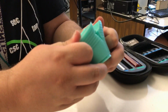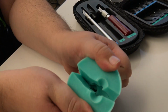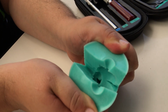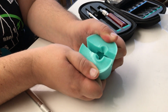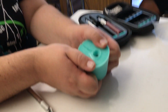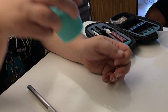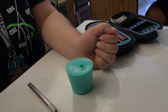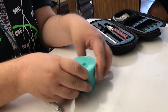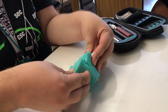Okay, and so I'm going to pass this around. Guys, try and be gentle with it so you can hold it by the bottom. Use your thumbs to peel it open, and you can see my rabbit-shaped cavity on the inside. And I'll pass it around. So when we go to make this out of metal later, I'm going to take the exact same type of cup that I made it in. I'm going to put this in that cup to help hold it still and tight. And then I'll pour metal down my little sprue funnel, and we'll get a little metal bunny.